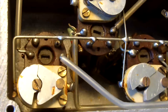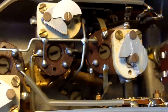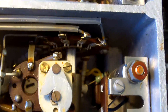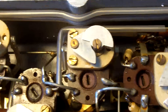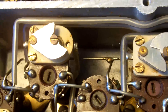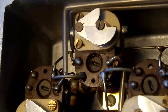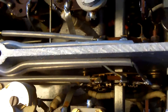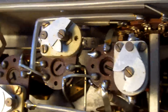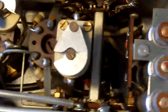The good news here is none of the ferrite cores are chewed up. Sometimes if someone's got into a radio like this, they've hacked up the ferrite cores with a screwdriver. But I get the impression that no one has been in here before — there are certainly no signs of any activity, which is good. But from a repair point of view, you wouldn't want to have to deal with one of these valve holders.